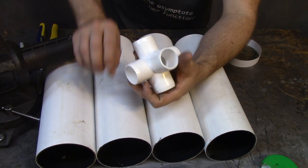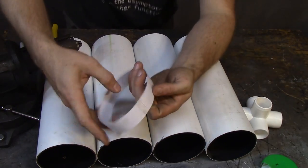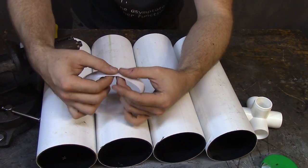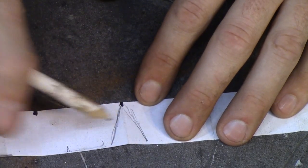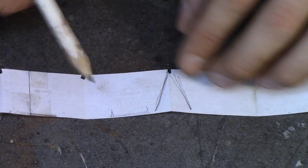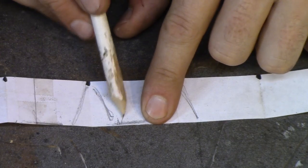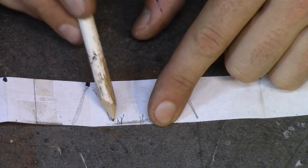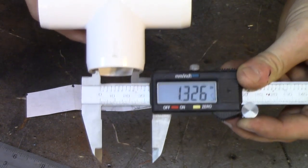First things first, I'm going to turn these into the bells that I'm going to put into this, so they need to shrink down. To do that I'm going to use my old paper trick where I take this — ta-da! The only part that's even slightly difficult, and it's really not because it requires next to no math, is that these are going to be cut into triangles. You figure out the circumference, divide it by eight, and that's your distance for material left between the triangles you're going to cut out. Just in case you forgot, circumference is pi times diameter.